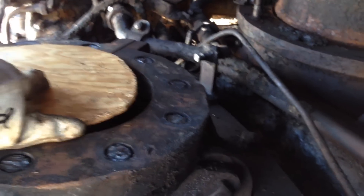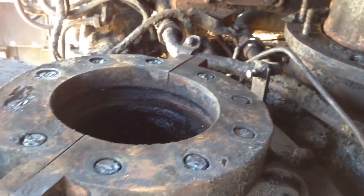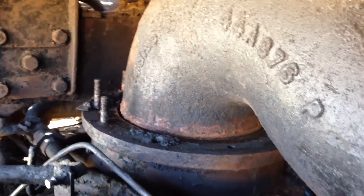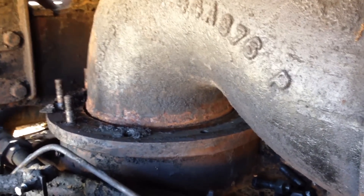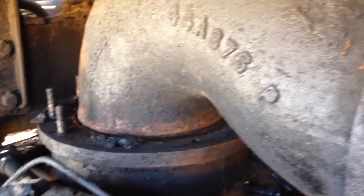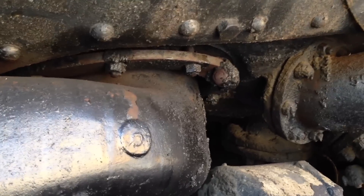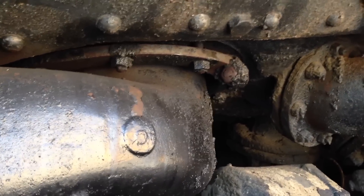We have to remove the component to restore it anyway — very large components coming off the engine. You can see this flexible joint down here on the gooseneck, which is an exhaust for the front engine, along with the slip joint right here, and a very large flexible connection back attaching to the underside of the smoke box, which combines with the exhaust steam from the number two engine.